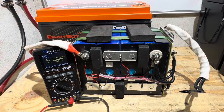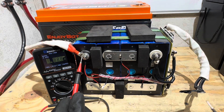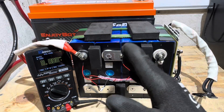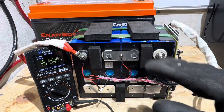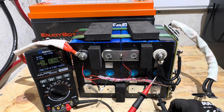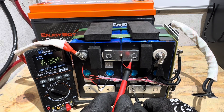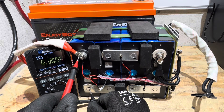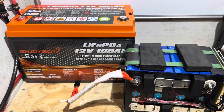New test: comparing the cell pack voltage summation against the BMS output. The actual pack reads 13.28 volts, and the BMS output also reads 13.28 volts — nice. Then I checked each individual cell for balance. Note: this pack was pulled all the way down for the capacity run and only partially recharged, not brought back to high cell voltage. Cell readings: 3.313V, 3.314V, 3.313V, 3.313V — a very balanced pack given it was pulled flat and only partially recharged. That's exactly what you want to see.